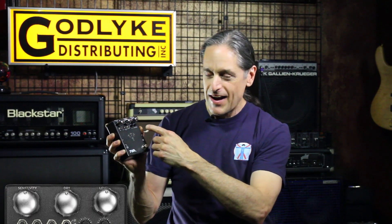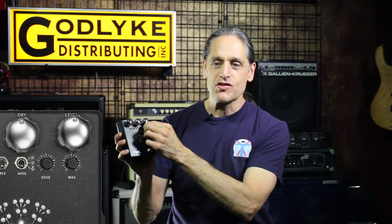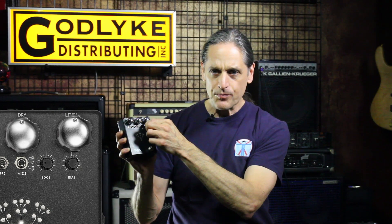So really proud of this pedal — sounds fantastic. It has the original three controls that the Brass Master has, but we messed around with some of the tonal filtering options. We added more, and left one off because we just didn't feel it was necessary. We also added a high frequency roll-off so you can warm it up even more or get it more aggressive. And then we also have a voltage starve control for the voltage going into the transistors, which allows for some additional interesting gain effects.